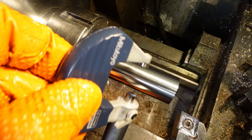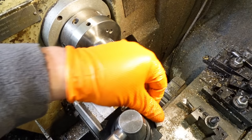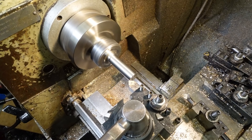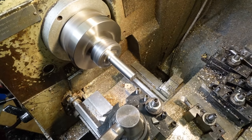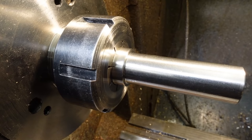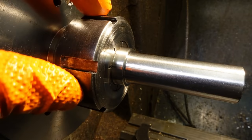Size looks good. Time to chamfer those edges before I cut myself. Again. One day, I'm going to remember to set up a chamfering tool that I can use the other way round. Right, those edges are less razor-like now. The shank diameter is 20mm, so I can use it in an ER40 or R8 collet, but more importantly, so I can't use it in a drill chuck and gall it up horribly. Self-knowledge is a marvellous thing.